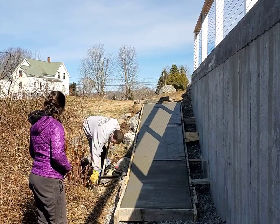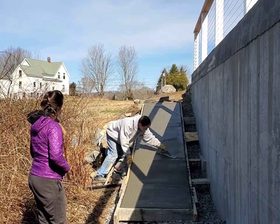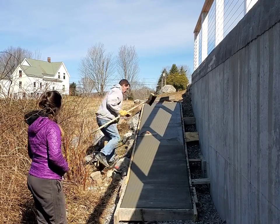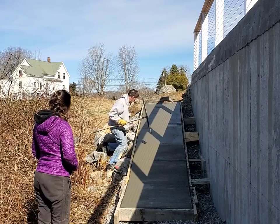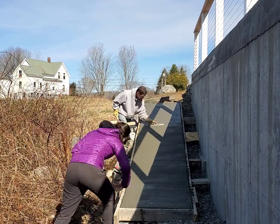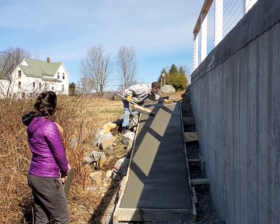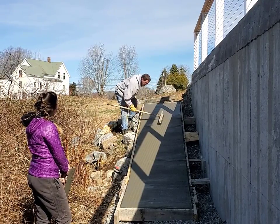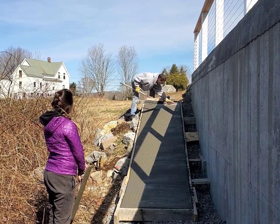I'm dealing with all those prickly rose bushes behind me — they kept catching on the broom handle and my pant leg. There wasn't a lot of room to work here, so that's why you just see me doing the magging and brooming. I get it all magged out and then broom it right after, and that just leaves a really nice broom mark.